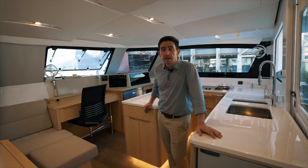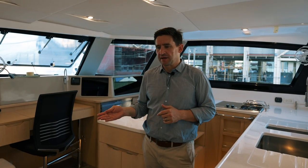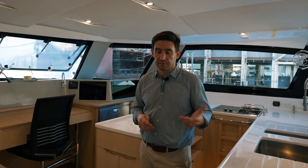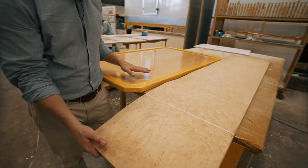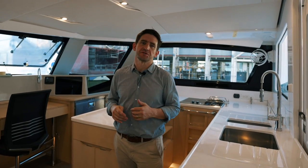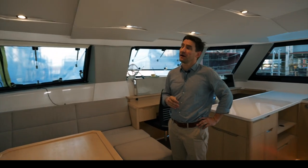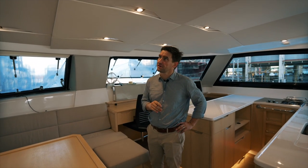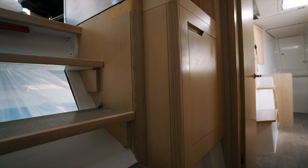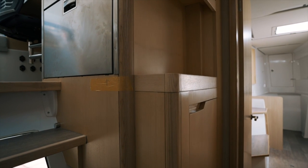There's a discussion about wood — we're looking at doing a different surface finish for the main saloon table as an optional item. We've got some maple we've been working through with a test piece in the wood shop, and I think that's going to work very well. We've got ash as the standard setup but we're looking at a few different options. The headlining panels are being changed in subsequent boats — we're simplifying, fewer panels, less joinery work. The wood is oil-coated, not varnished, and we're changing the catches so you don't get fingerprints on the wood over time.